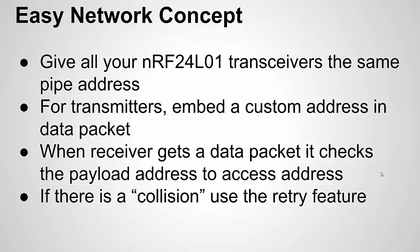You could also do this in reverse: if you have a single transmitter and a home automation setup where you want to tell other nodes what to do, you transmit out and all nodes receive it, but they unpack the data and check which address the command is meant for. The downside to that approach is if you're using battery power, you may consume more battery because all receivers in the field are going to receive every transmission.